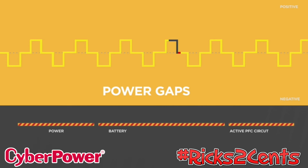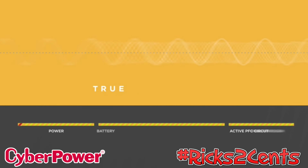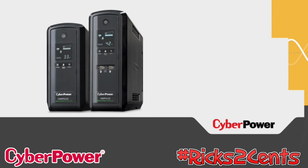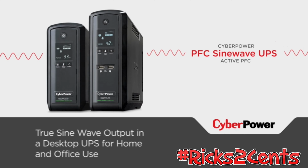An active PFC circuit may detect the gaps as a loss of power and shut down the equipment without warning. This can result in equipment damage, data loss, or both. A UPS system with true sine wave output meets the demanding requirements of equipment with active PFC circuits. It ensures reliable operation and peak performance.